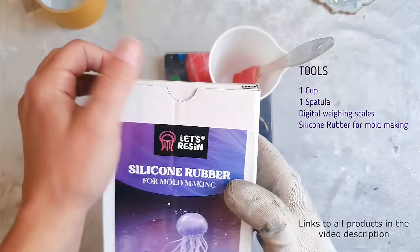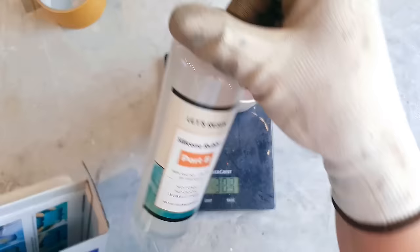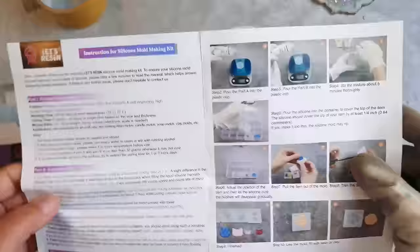So I like using transparent platinum silicone, and this one is by Let's Resin and it's sold on Amazon. And I'll leave you my affiliate links in the description so you can buy from Amazon US, Amazon UK and Amazon France. So this particular platinum silicone is a medium density silicone once it's cured, so it's quite bendable, and this is useful if you have large or complicated castings.